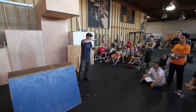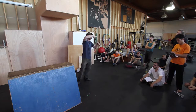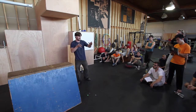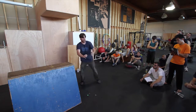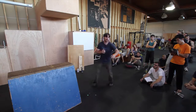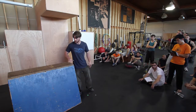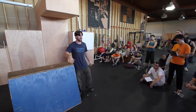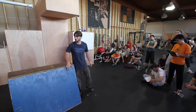But if you land on that frame in just the right way, it'll support it because it's built so that when you land on this, it pushes things down into the ground or whatever. You're going to build your supports so that they take that impact straight on. But if you then go to the side and you try to twist the structure apart, you'll pull apart. So one of the first things that I learned is that when you're putting sheeting on something, use a ton of screws, go into every single framing member that you possibly can, and it will tie the whole structure together.